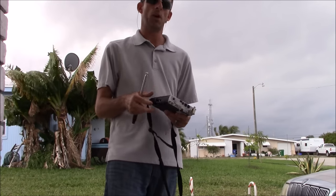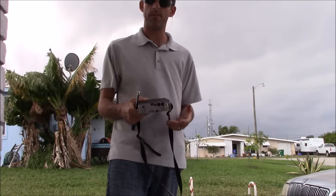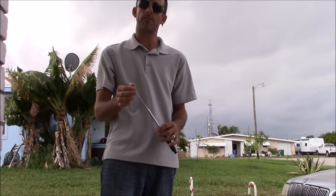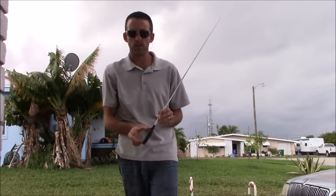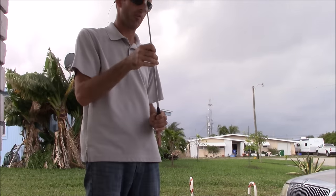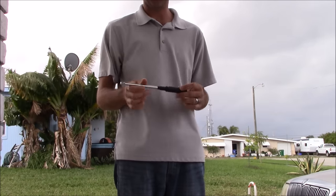With the proper counterpoise wire, you can tune your SWR down to about 1.1 to 1. For 10 meters that's about 6.3 feet. For 40 meters, the counterpoise would be upwards of 25 to 30 feet. The 40 meter ham stick is the same physical length as the 20 meter but uses a base-loaded coil to achieve 40 meters electrically. These sticks are great — they collapse into a very small form and you can get them for every band.